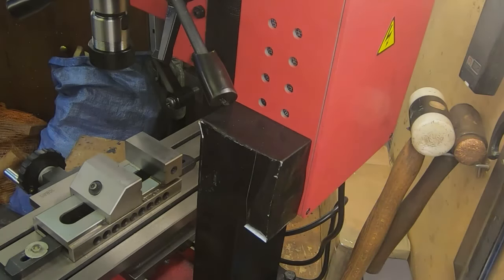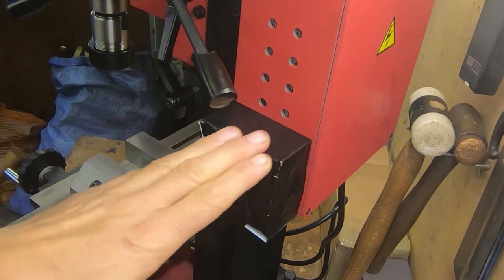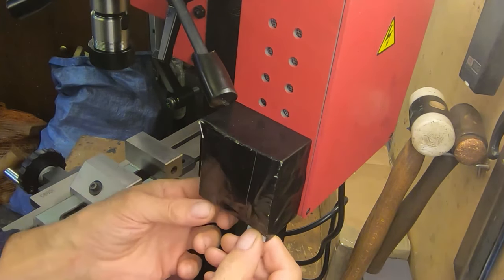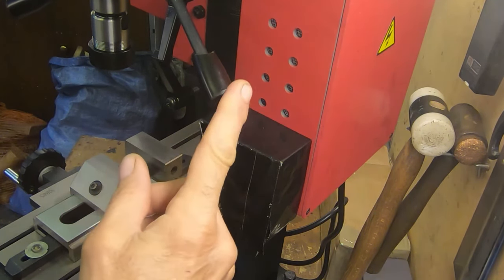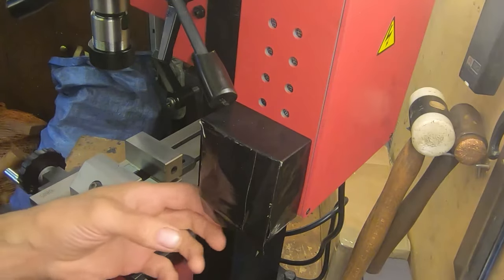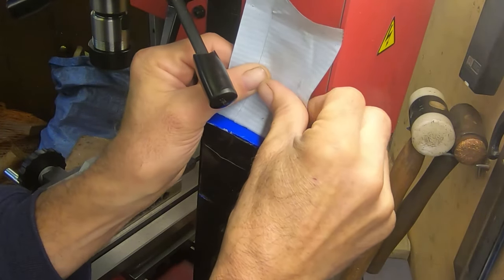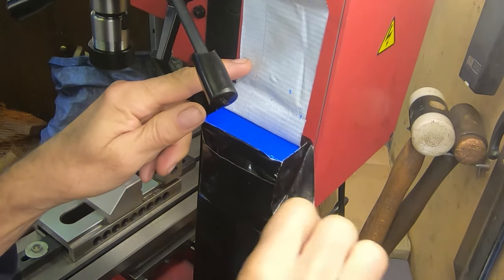In fitting this vertical DRO, we're going to have to rejig these electrics that I originally did for the Hall Effect Speed Sensor. This was a bit of a bodge — a 3D-printed box which wasn't a good size, because every time I turned this handle it conflicted with the edge there. So I'm going to shift this to the other side, and the plan is to use the 12-volt transformer which we repurposed to go inside this box to run the Hall Effect Sensor.